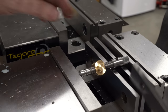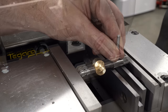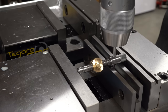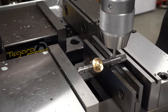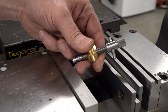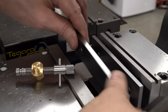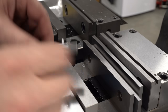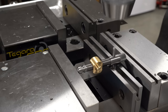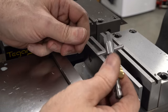To actually press it in I'll set it up on a couple of parallels and use a third parallel between them to control the distance - I'd like this to be nice and centered so I did the math. I'm using a little stub of brass in the drill chuck to push this through until it contacts that third parallel, knowing it will be exactly centered. Well, I almost always do the math correctly - apparently I didn't in this case. After checking the sizes and doing the math again with the correct size parallel, we'll put it back in the other direction and push it back so it will be centered. And that is much better. That's the screw assembly done - I put the nut on the screw before doing this because I don't want to take it apart again. And that's the tool complete.